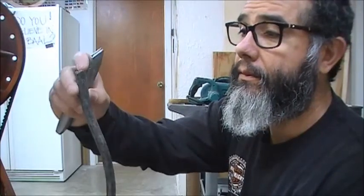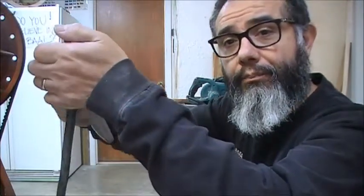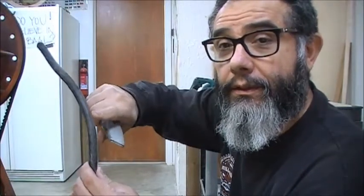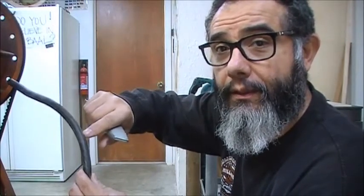Now, I was taught by an electrician to cut down a few inches, right? And if you need to, on both sides, and then peel it back. Again, I'm not an electrician, so I'm not going to say which one's better as far as electrician, but logic tells me that if I cut the jacket along the length of it, there's a high risk of damaging the insulation on the individual wires inside.